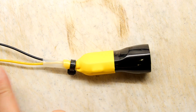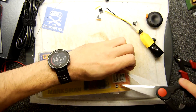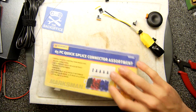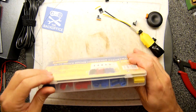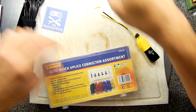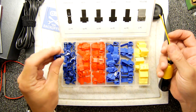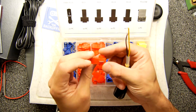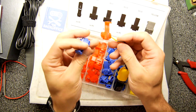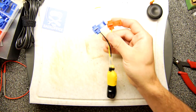And that's it ready to go. I'll just show you the final thing which are the fittings I'd use to put on the end. Get yourself one of these splice connector kits — I'm just showing you that you don't have to go and spend a fortune at RS or Halfords. This is just a standard one I picked up in a local town shop — a cheap brand like Rolson — and this whole box was about four pounds. It's a fine selection. You can use the small size if you want, but I like these ones better. These ones are almost translucent — you can almost see through them. You poke one end in like that and the other end in like that, and you can just crimp these onto any existing wiring in the car.